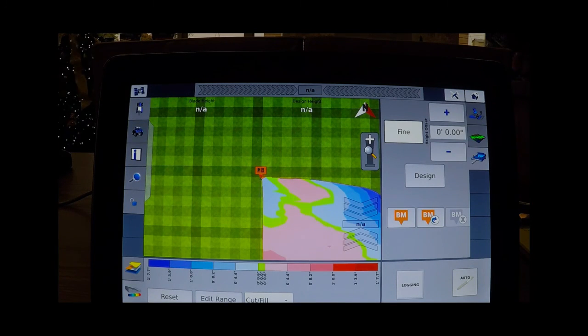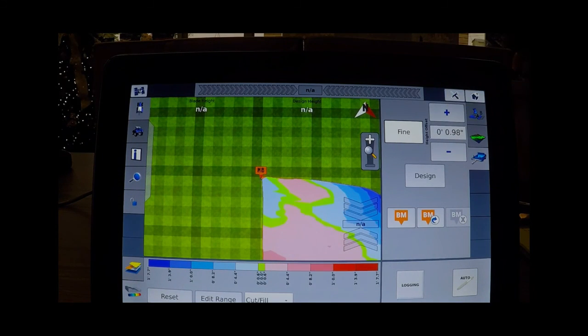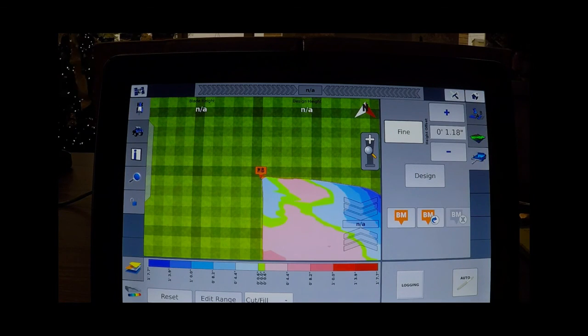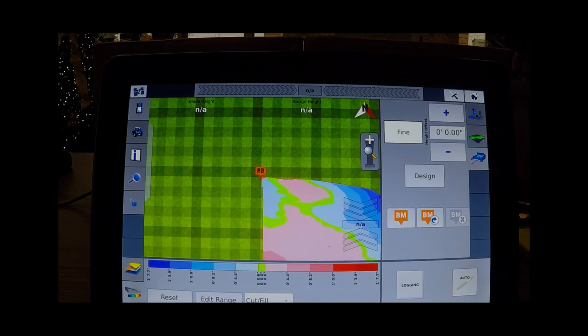Now then, if you cannot start cutting it all at once, you will have to add to this, which is your target height of your automatic control. Down here is your design height, which is your finished cut, plus this much above that finished cut, so that you're allowed to cut up higher and come down gradually till you get to your predetermined height. Remembering, whenever you get to 0, 0, 0 here, that is whenever you're to the design that you have done within this particular section. So you have all of these capabilities within Field Level 2.